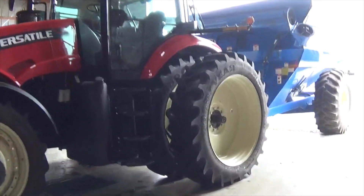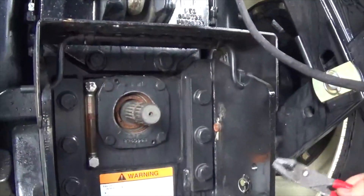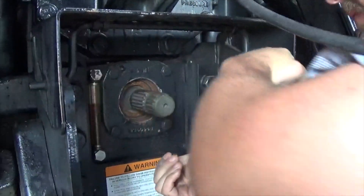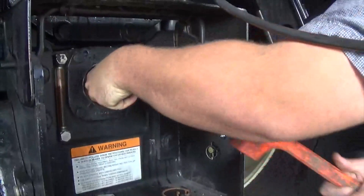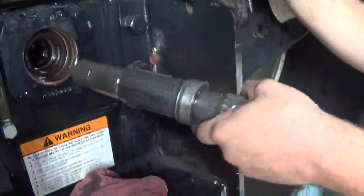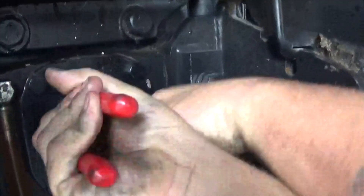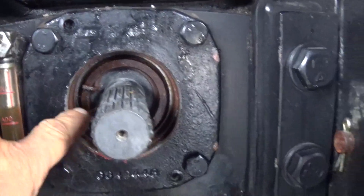Here's some bonus footage. Here is a 260 that has the dual speed PTO option and I am out here with Tyler from Kunze Equipment in Arthur, Illinois. We're actually going to change this one from the big thousand to the small thousand, but in theory with the dual speed this is also the way you would change the 540 to 1000 combo. We removed the snap ring — this shaft had never been out of this tractor. We had to work it a little bit with a dead blow hammer and some penetrating oil, but we did get it out. It just took a little bit longer. Just a five-minute job.